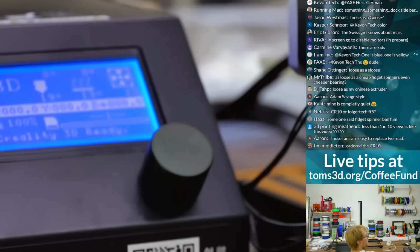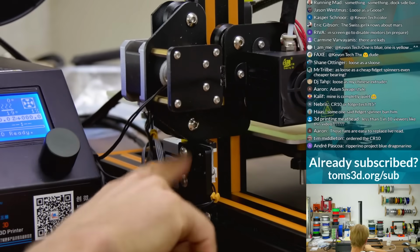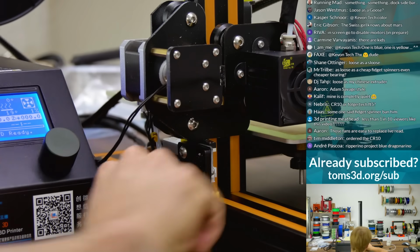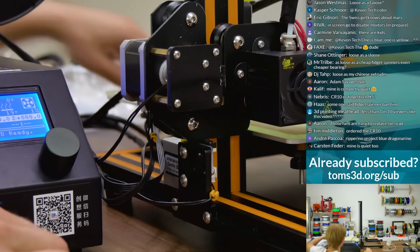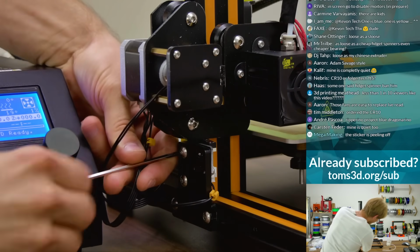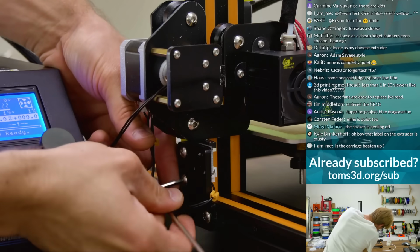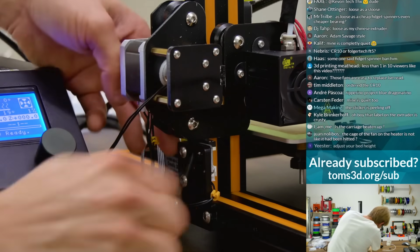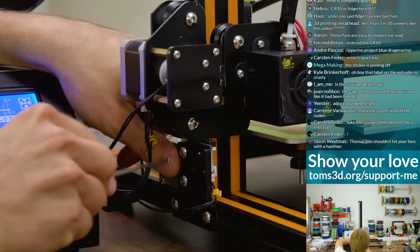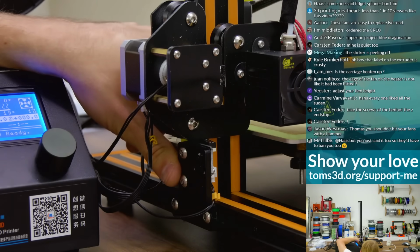Okay. So there's our Z-axis end stop, and that's what I noticed when assembling this. It appears that this plate right here that mounts the end stop can actually slide up and down. So let's loosen that up again and drop it down just a tiny bit, like 5 millimeters or so. Yeah, why did I tighten this up so much? Can we actually? Yeah, not enough.